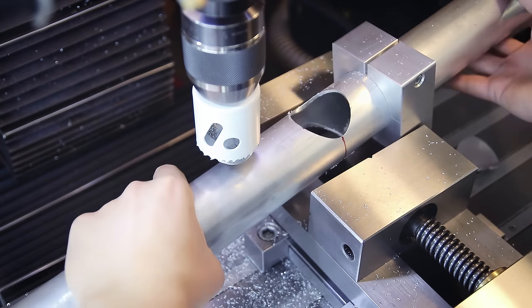Now I need to figure out how to cut these round miters. It seems pretty complicated at first because there's a lot of intersecting angles, but it gets a lot easier with the right approach — which involves cutting both sides at the same time. And that involves building yet another fixture, which I'm going to whip up from aluminum extrusion. The idea is to build a frame that accurately holds these two parts in position relative to each other so that I can handle them as if they were one part, and then move the entire thing over to the milling machine to do the miter cuts.